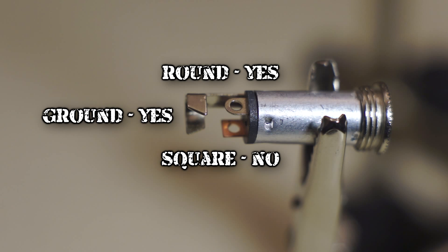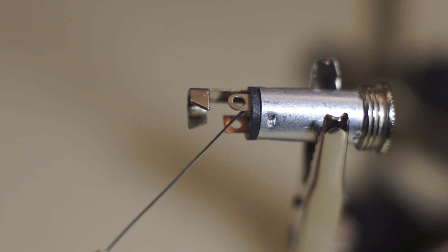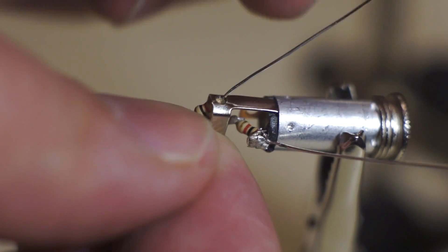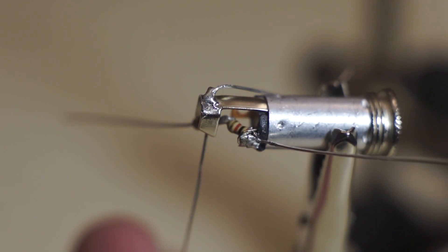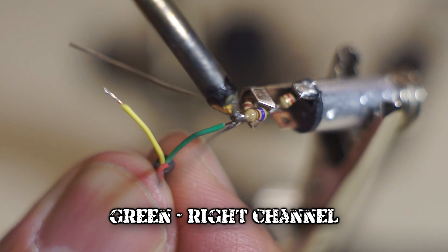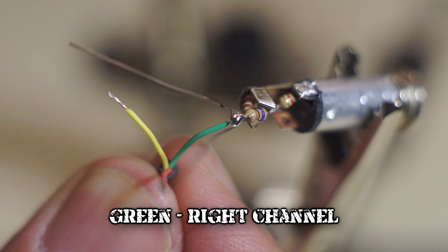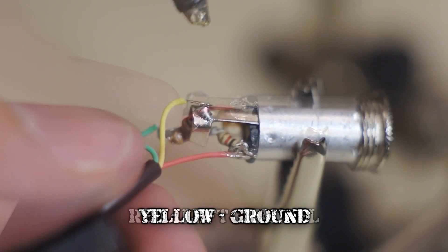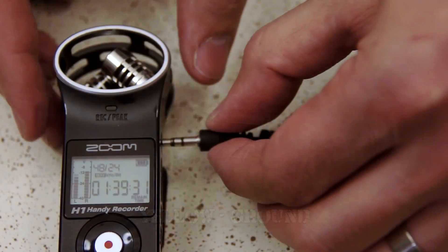Here's the metal insert of the female plug adapter. We've got a round solder connection near the base, a longer ground connection, and a square connection which we're not going to use. Next, I'm going to take my 1500-ohm resistor, slide it through that rounded solder connection, and dab some solder right in that hole. The 1000-ohm resistor I'm now going to attach to the ground by sliding it through the ground connection's hole and soldering it up. Now twist the two resistor wires until they touch, then solder them together. Then I take my green wire — which is the right channel, the one that is 12 dB lower — and solder it to the resistors. Then I take the red wire, the left channel, and solder it to the rounded connection; this is your normal signal. Last, take the yellow wire and solder it to the ground.